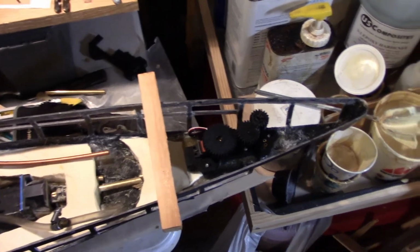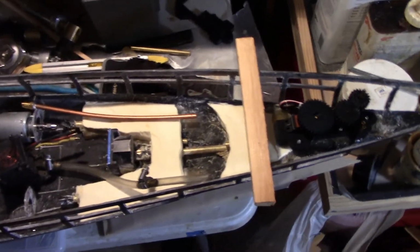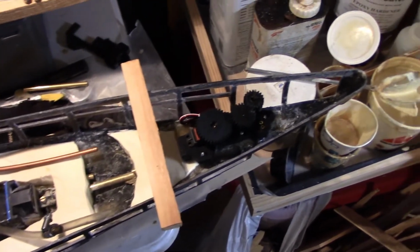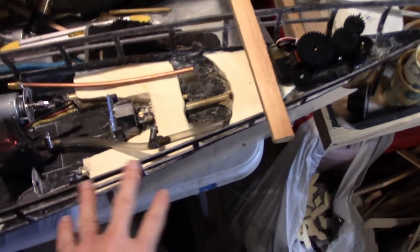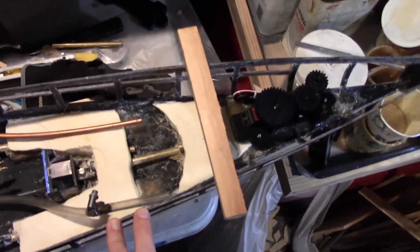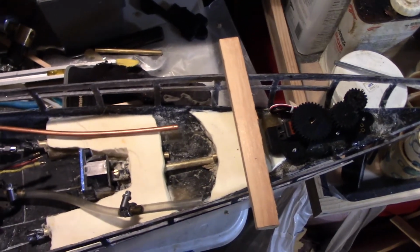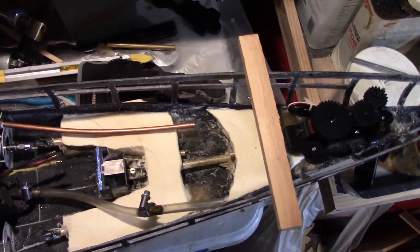For this boat, because it's longer than the standard plywood length of 4 feet, I have to determine where I want the break to be between the two pieces of plywood. In this case, I'm going to use that to my advantage, and I'm going to use different thickness deck and subdeck in the very stern relative to the rest of the ship. In the very stern, I'll probably use a setup like I have on the Congo with the 1/16 inch fiberglass deck and the magnetic tape as the deck seal. The reason is because it creates a really good deck seal.